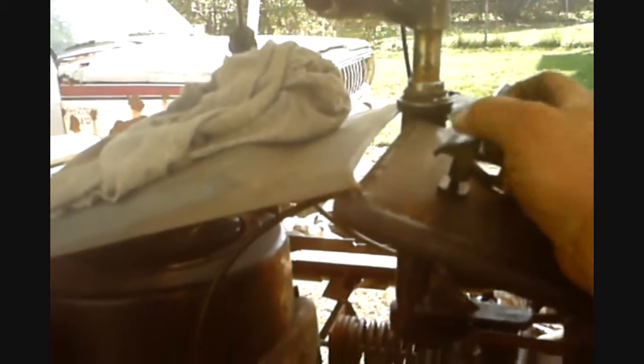Here's a hand choke. I already had the hole inside the dashboard for it. To put this onto the carburetor, originally the carburetor throttle had the choke actuation at full throttle, then just a tad more it would close the choke. I didn't like that. I wanted it independent from the throttle, so I deleted the arm going to the linkage. And I added, it's just a ride mower choke handle. A little square hole I put into the dashboard to make it fit, and it comes down.